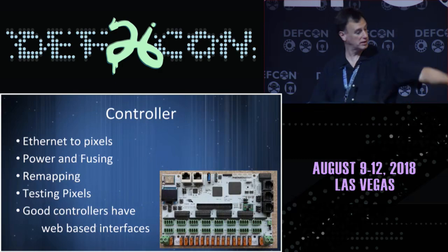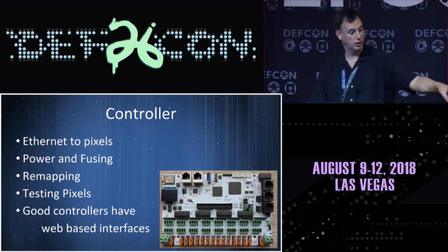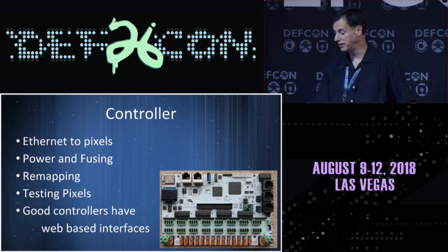So the controllers, this is what's inside that gray box. It's an Ethernet to pixel controller. This is one of the favorites in the industry. This is about $200. But if you look at the green connectors along the bottom, there are 16 connectors for various strings. You can have hundreds of LEDs per connector. And there's even a daughter board that will double the connectors and double the light outputs. So it will take the Ethernet in and then convert it to the protocol that the strings need.